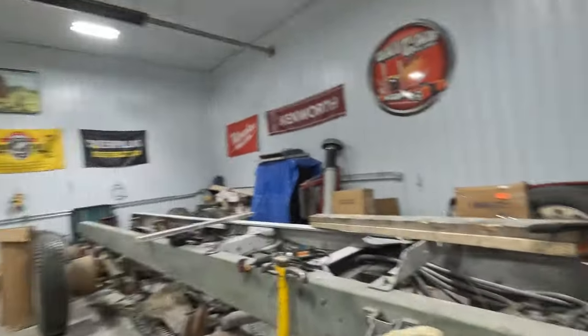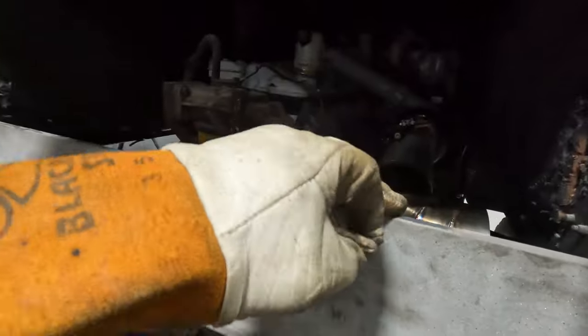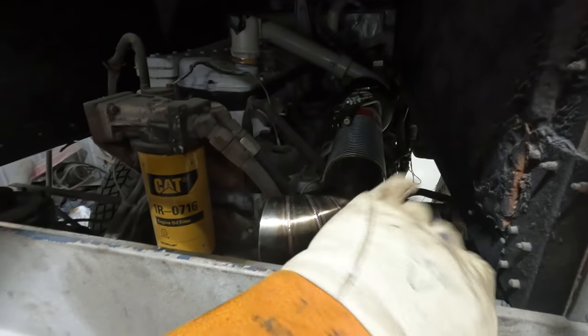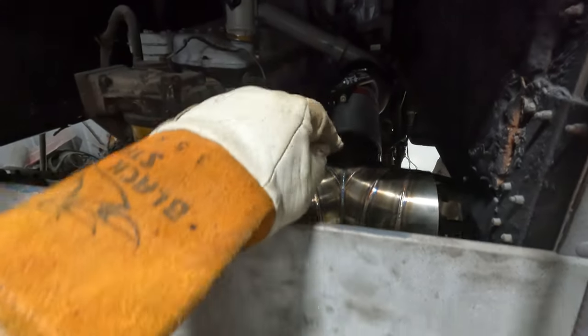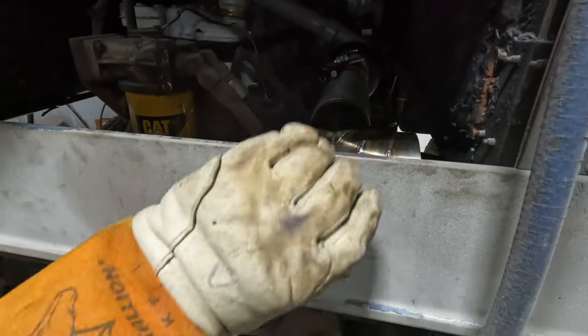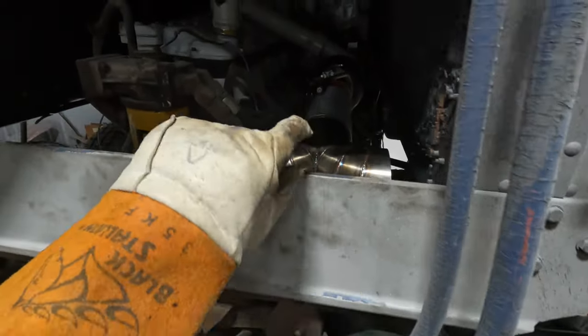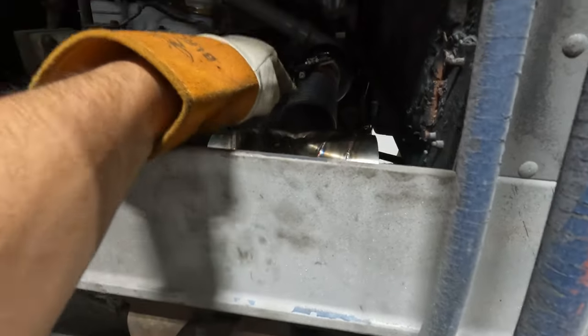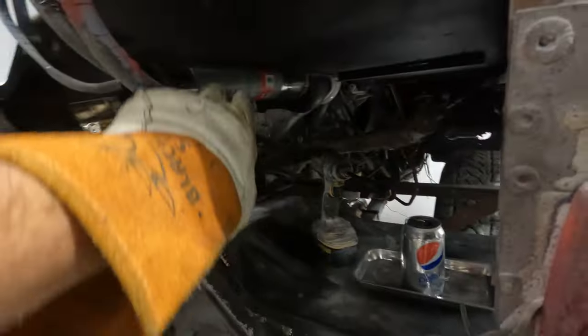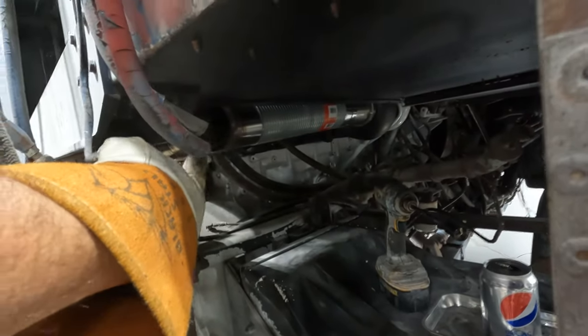All right, so Mark came to give me a hand. We measured out the Y branch and decided that we don't wanna roll that end up just to pitch that end down. That looks like a shortcut. I'm gonna offset this pipe with the flexor, so I'll redo all that. And what I'm gonna end up doing after it offsets down, it's gonna clear underneath here. So you can see the pipe coming out there.